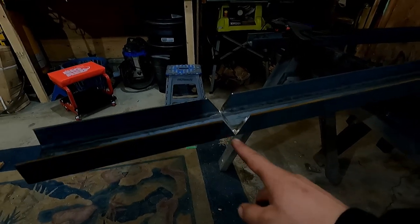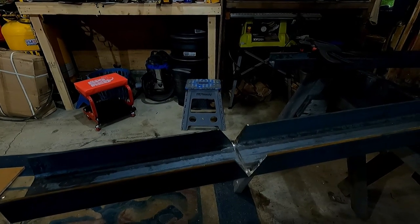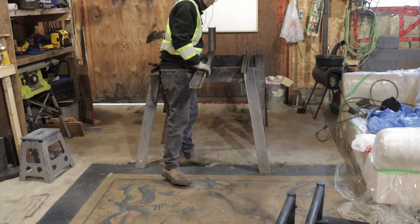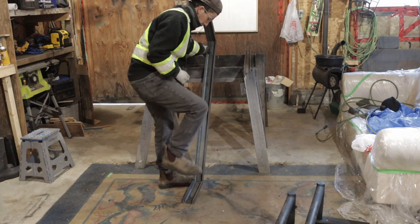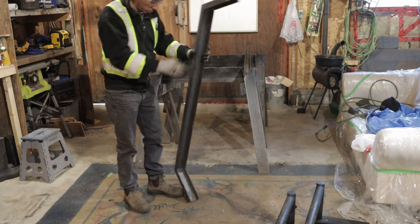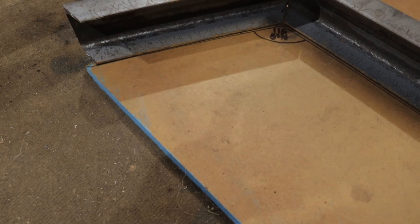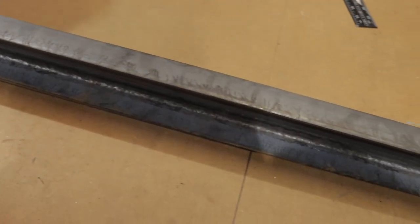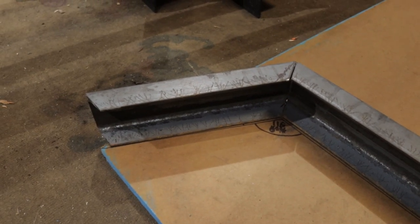Here's what we have done. Once you cut out this V right here, you also want to cut it right in the middle — that way when we go to bend it, it's not going to be as hard. I'm just going to lean it against the saw bars and apply some pressure like this until we reach the desired angle. Using the lines that I drew on this piece of plywood I can perfectly line up the rack with those lines, ensuring all pieces are at the exact same angle.